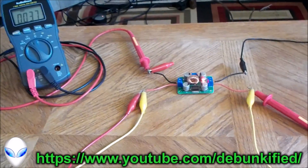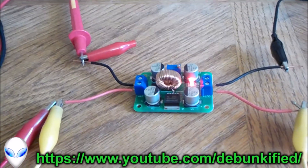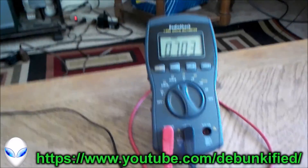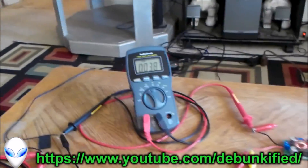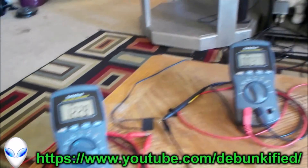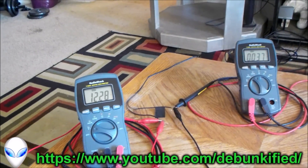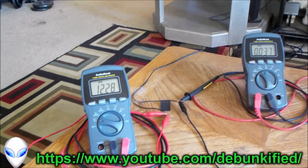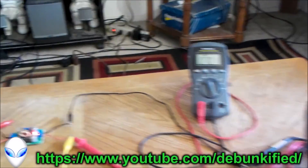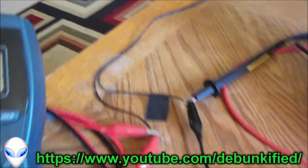There are a few things I would like to say here. I've traded out these with other brand new circuits and old circuits and it does the same thing. I've swapped out all the meters with each other and it does the same thing. I've tested and made sure my meters are working properly using just one resistor to test current from the voltage source and they were all the same using Ohm's law, and it all came out exactly the same. So the meters are working just fine.